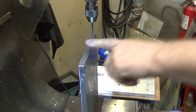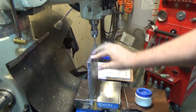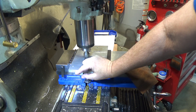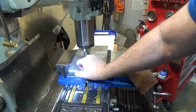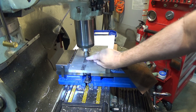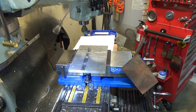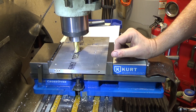That barely made it - if this thing were even a quarter inch taller I wouldn't be able to fit it in my mill. I'm going to take these over to the tapping machine and tap these two. You can see here my embarrassing screw-up with the taps - two taps broke, so I ended up putting a hole 1.25 inches in. I drilled two holes the second time because I was worried about the tap breaking, used a heavier tap and it still broke. I have a problem with 10-24s - either my hole size for the tap is wrong on the chart or I've got crappy taps for 10-24. This is the half-inch shaft and we've got to create a relief for the bushing that goes in here. It has a lip so we need to go that far in. We're using a one-inch end mill, making a relief going down 63 thousandths of an inch using the knee.